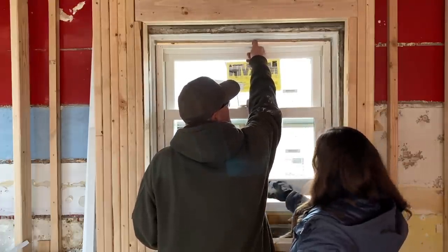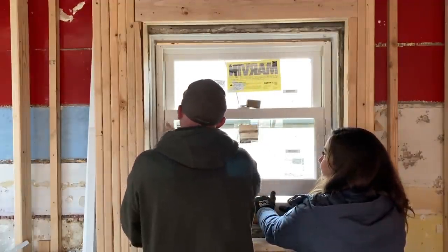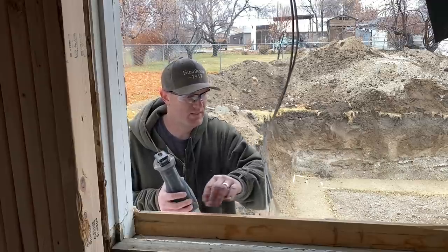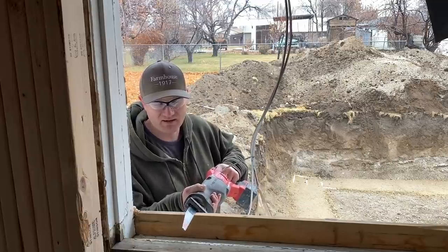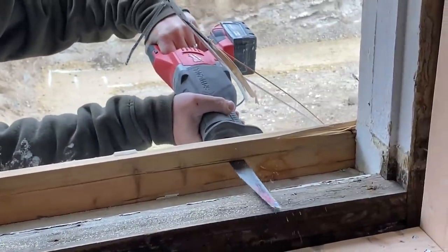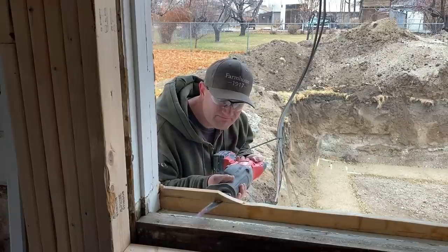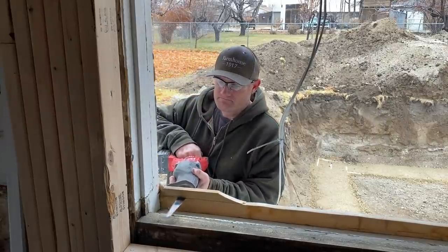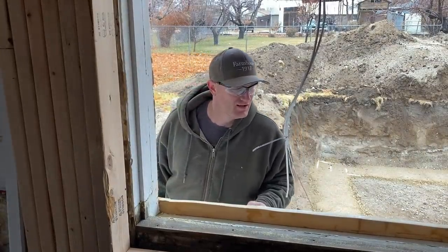And then this will have to actually go forward a little bit. So that's what it's going to look like and then we'll trim it around. I'll hold it this way. You go out there and nail it in place. So this board is going to stay in but I've got to cut it down about an inch. I'm just going to leave it in place and use the sawzall. I dipped a little low down here where it broke, but that'll be alright.